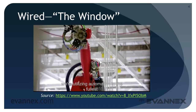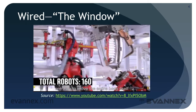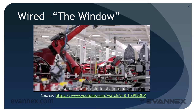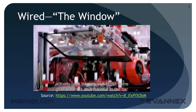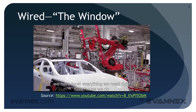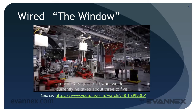We're utilizing automation to the fullest. We have a variety of robots, from the tiny little ones to huge ones that are able to move the entire body itself. One robot I'm always very impressed by is the one that puts the seats inside the Model S. The same robot is able to change tools — going from a seat handling device to installing the windshield: grabbing it, applying glue around it, putting the windshield onto the car, as well as doing the rear glass. We do the majority of our stamping panels ourselves and have design engineers here at the facility, so we're very nimble and quick at what we do.